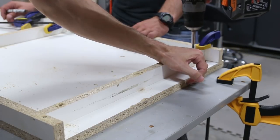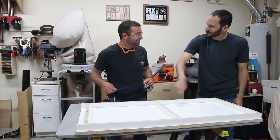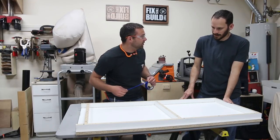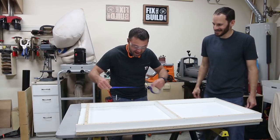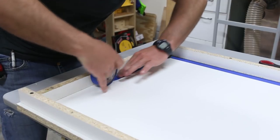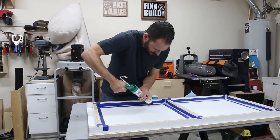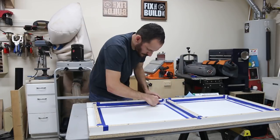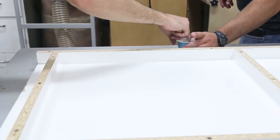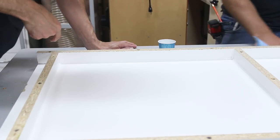We secured the other end, vacuumed the form clean, and here's where Pete showed me a cool tip to get the silicone bead in the form for nice clean edges. Last time I just siliconed it and used a trowel — it was a little hard to get into the edges. Pete explained that it works but it's harder to get a perfect finish, especially the first time building concrete. So we taped around the whole form leaving about an eighth to a quarter inch gap for the caulk, applied the caulk, smoothed it out with a wet finger, then removed the tape right away before it set. Going back over the caulk one more time with a wet finger smoothed out any little lips left from the tape — a cool trick to make sure the caulk went exactly where I wanted without getting all over the sides.